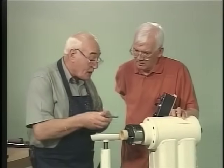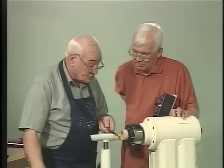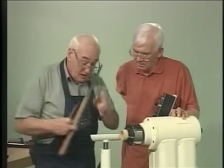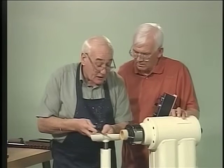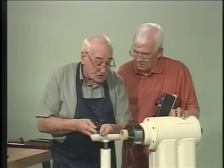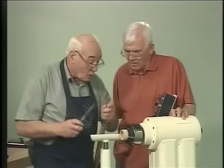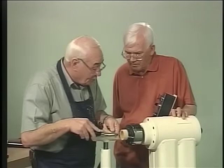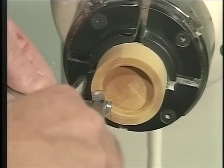And now it becomes obvious why we use the hand rest, the tool rest, in conjunction with the chasing tool, instead of working over the rest. If I work over the rest, what happens is, as the chase goes in, the chaser takes the least line of resistance and comes off the thread. By working with the armrest with the hook on, what I can actually do is, I can pull the armrest towards me, which keeps the chaser into the thread.